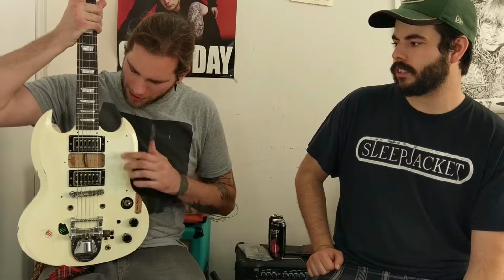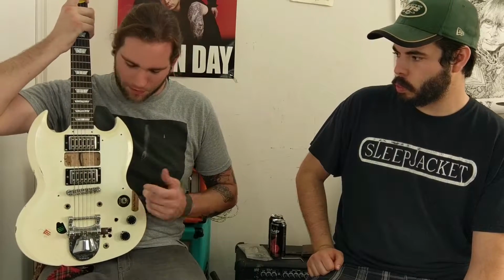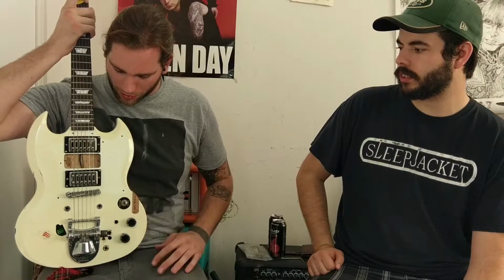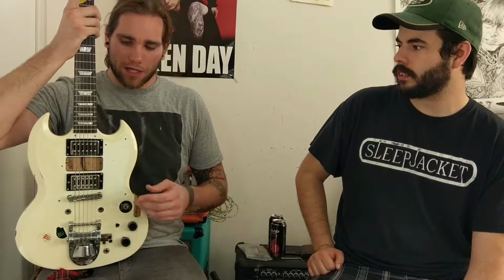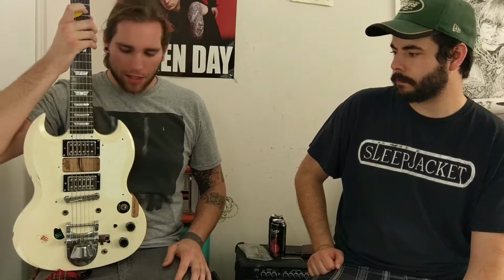These in particular come with, I believe they call them Neo Toaster pickup covers. That's totally optional. Pickup covers are optional. I just liked them on this. They don't impede the sound so much because all the coils are exposed. It's not like a standard humbucker where you have slugs that are under the cover and then the screws that are exposed. And both rows of screws are fully adjustable. It's not like you're stuck with the one row of slugs that are at a predetermined height.